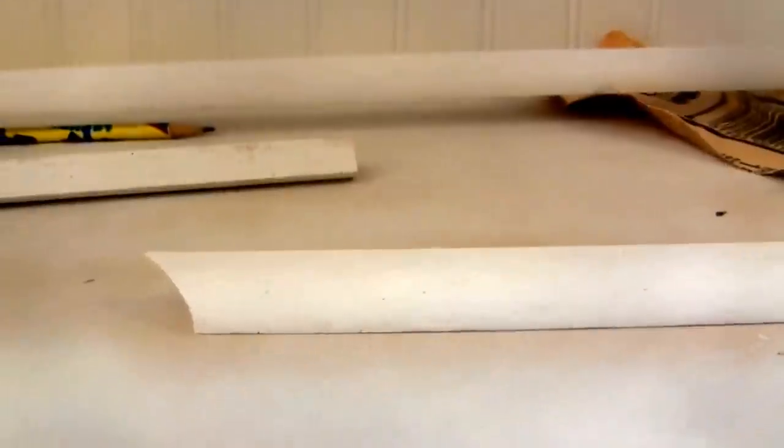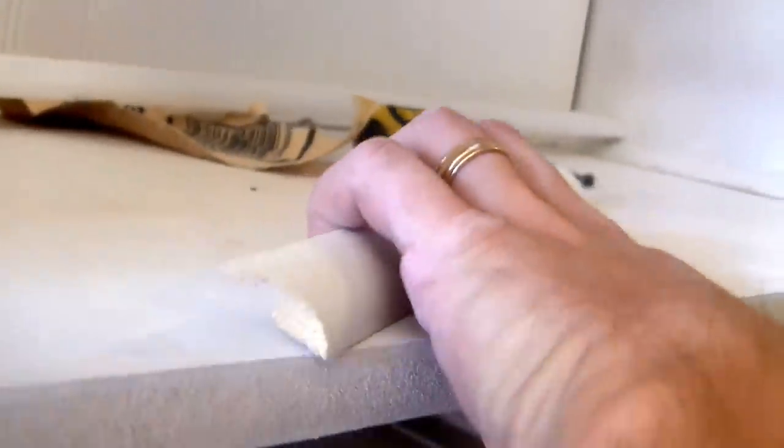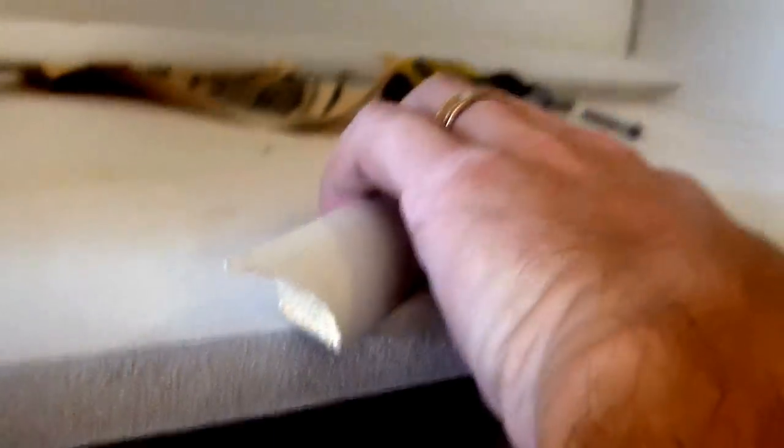I'm pretty happy with how the prototype turned out. What I'm planning to apply is a 45-degree cut on the corner to the inside for the long piece across here — I've already cut it. I just need to cut the corners on the inside. One thing I noticed: it looks like a straight 45-degree cut on top, but I've already coped it out. You come along the side and you can definitely see how it slopes and follows the shape. On this one I used my coping saw and cut out the inside.